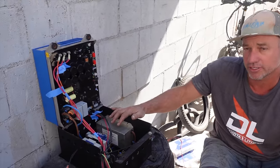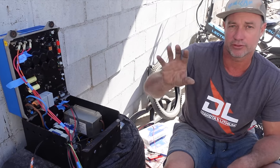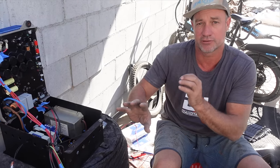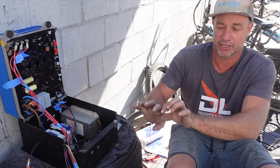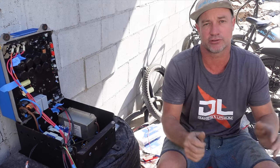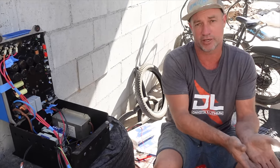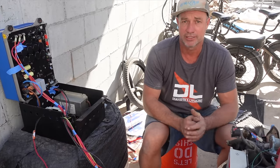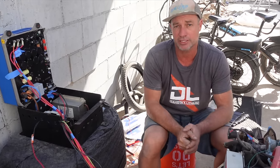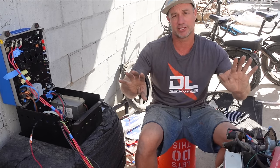Once we do kick this over and get power, this is going to put it from three phase into here, which will give us our 230 volt — which is European, so it's not what the boat is; the boat is 110 volt. So I'm going to come out of here with 230 volt. If we do run a dive compressor or any heavy equipment that needs a good amount of power, we'll run it through a plug here at 230 volt, and then it'll go through to a transformer which then goes to our boat and runs it all as 110 — so it steps it down from 230 to 110. We'll also have the option to run 230 or 240 volt if we need a welder or a dive compressor. It's just options. It'll be there because we've got 230, and we'll put an outlet in between the transformer and this one.